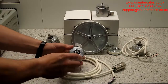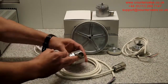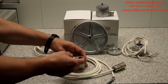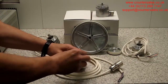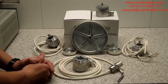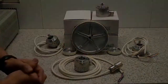Here we've got one that is a synchro flange with a 6mm shaft and the industry standard M23 12-pin connector. With this kind of encoder you would need a suitable plug and cable to go with it, and we supply all those kinds of things as well — wheels and other accessories that go with the encoders. So that's the AC58, the absolute encoder from Hengstler.